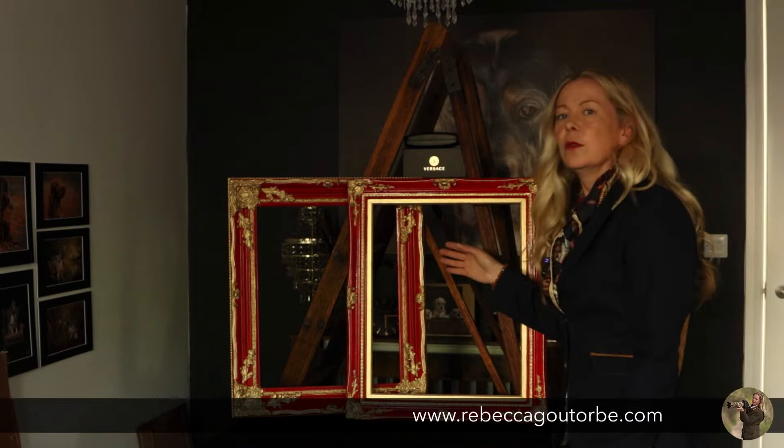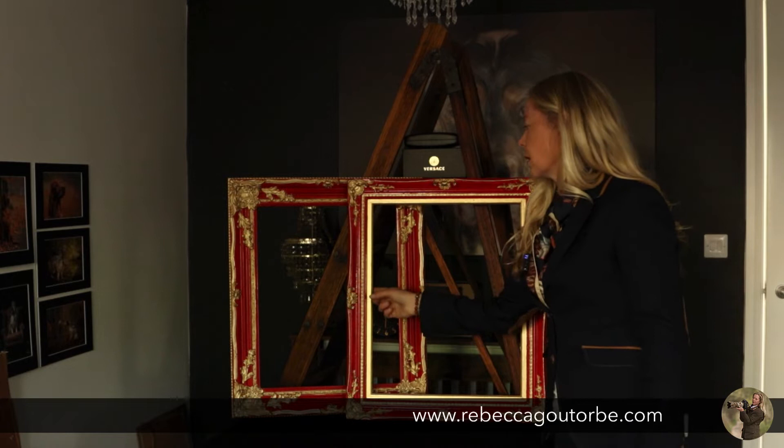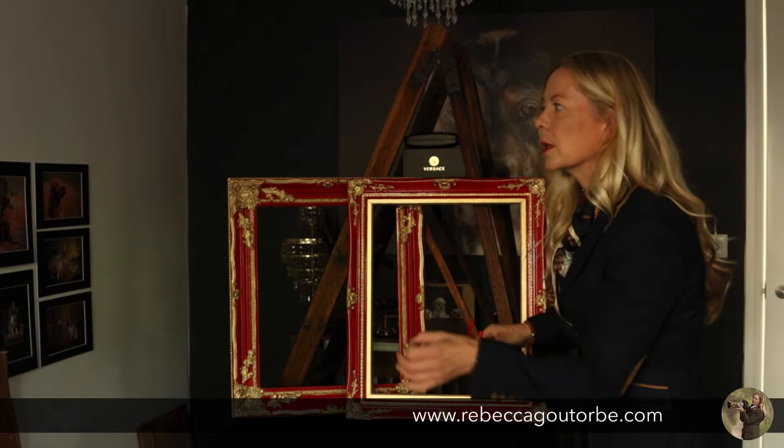Step two: I removed the mirrors because I did not want to tape them up — I wanted to do a proper job. Because if you don't take the mirror out, and these mirrors were white, and you paint the edge of the mirror, the inside of the frame that's white is going to reflect back and it's probably going to annoy you because it hasn't been done properly. So remove the mirror when you come to paint the inside, and make sure you do the inside and almost the back as well.